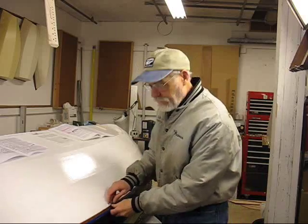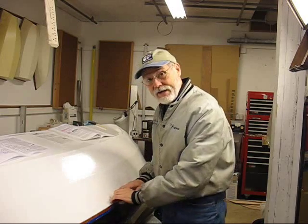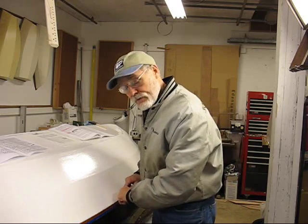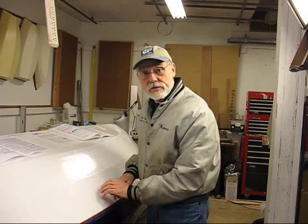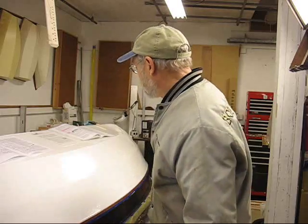The other thing I want to mention: when I was taking off the masking tape, it was a bear to get it to break free from the LPU white. I had to take a very sharp, brand-new X-Acto blade and run it along the edge between the trim and the hull to cut through those three coats of LPU paint in order to lift the tape off. That white paint is going to be on my shoe until the soles rot off.